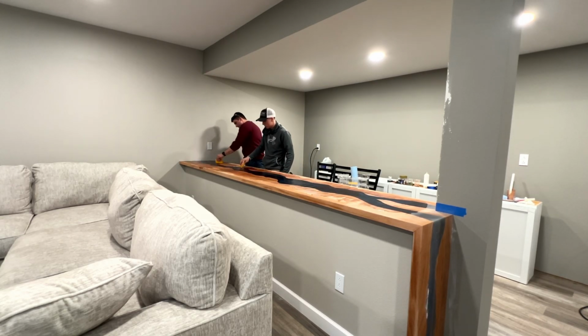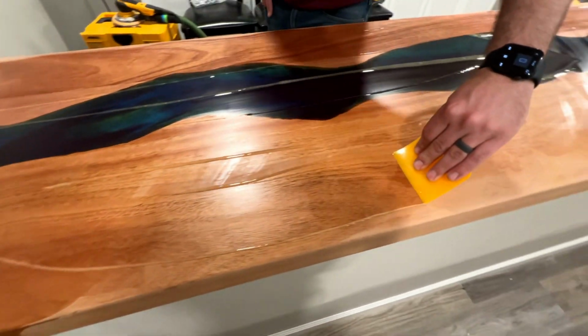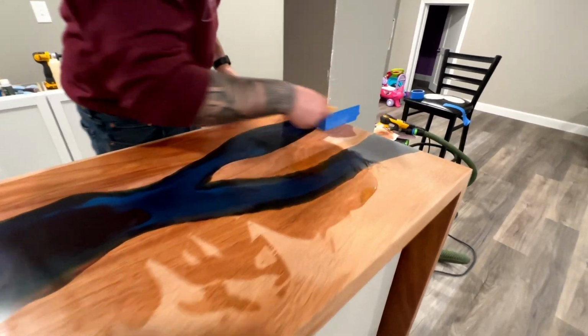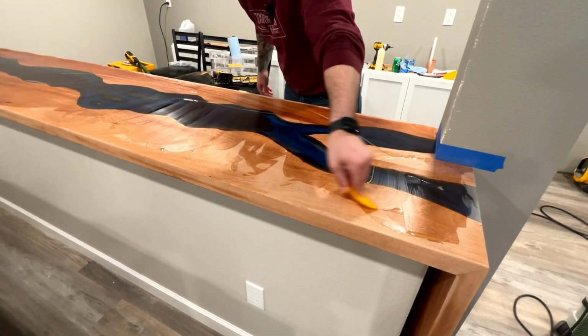After mixing for about 30 seconds, you're then good to drizzle it on and spread it out using a plastic squeegee or use any other method that you've seen or approve of. You then buff in the finish once all is spread before letting it rest for about 10 to 15 minutes. After its power nap, wipe off any excess and check for any missed spots, just to be sure.